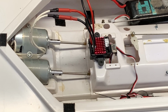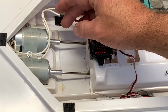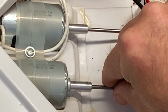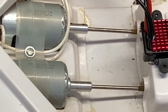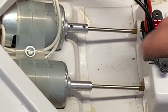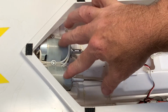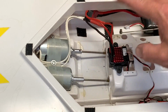They sound great. Now, the whole series thing, I want to show you guys something here. They're both turning, right? Watch this. Now, granted, I'm not giving them full throttle, you know, but... So, don't do that at home, guys. But anyway, in the series, if this motor stalls out, it gets held up, the more the power goes through this one. Like the resistance of this right here shorts out through the armature and all that, goes over into here. Granted, it's not 100% flow, but it's there.